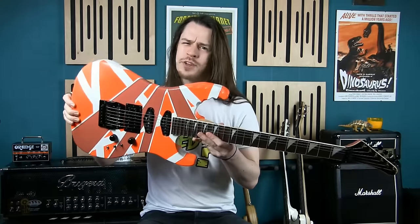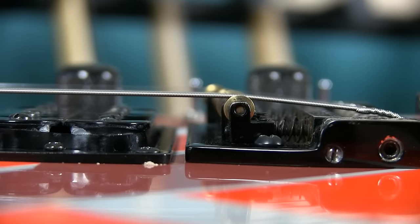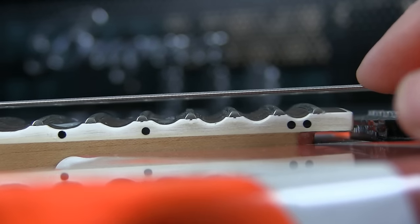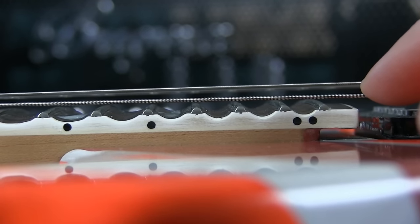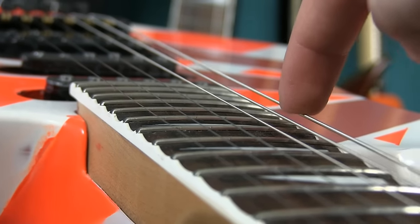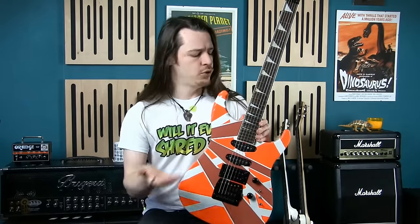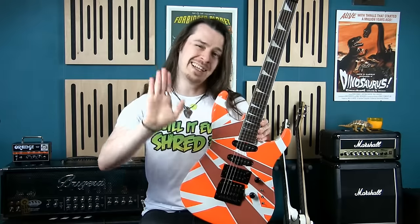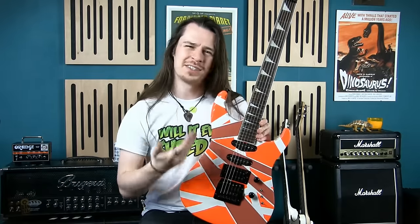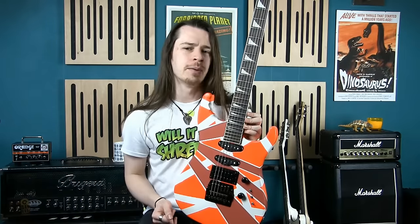I would love to show you this shredding right now, but unfortunately when I put it all back together I came across an unexpected problem. That's as low as the bridge saddles will go — check out the string action, it's a mile in the air. Now I know I removed some paint from the back of the neck and levelled out that neck socket, but I didn't think I'd removed that much material. It even looks like the neck should be sitting lower. With action this high, this guitar certainly can't shred, but there are a couple of ways we can fix that. The quickest way would be to shim the neck, either raising it up entirely or tilting it back. That would bring the neck closer to the strings and solve the problem, but it's not the best way to do it. The other option would be to recess the bridge — remove material from underneath so the bridge sits lower, bringing the strings closer to the neck. This would be the better solution, but it is a bit more work.